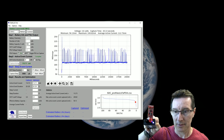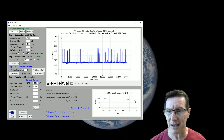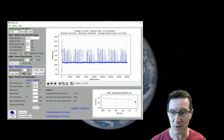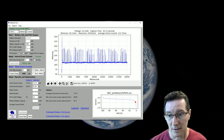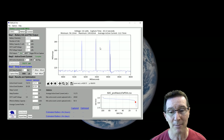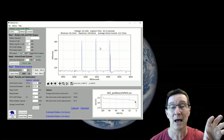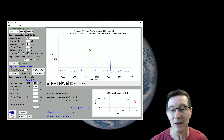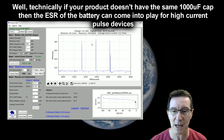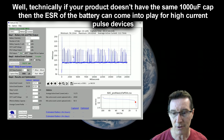There we go — the LED comes on, it's capturing 20 seconds. We should see peaks in the hundreds of milliamps. Ta-da! There it is. Beautiful. You can see it started up, ramped up, peaked at about 250 milliamps maximum, with average peaks around 160-175 milliamps. We can zoom into those peaks. They're very short duration. The active event current average comes out at 112 milliamps.